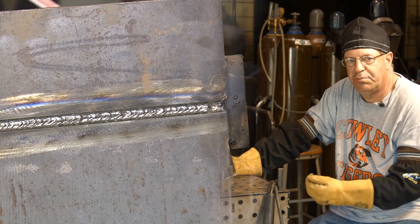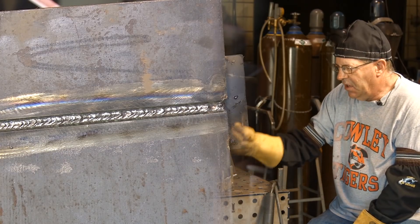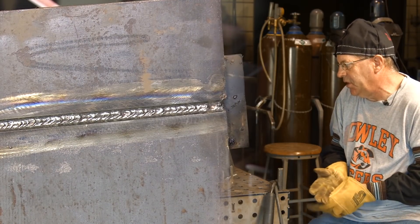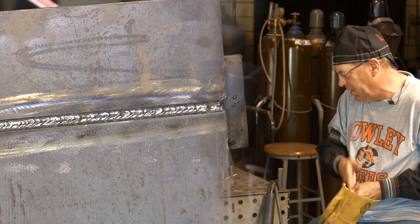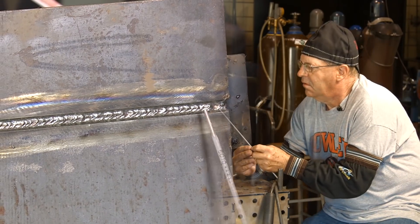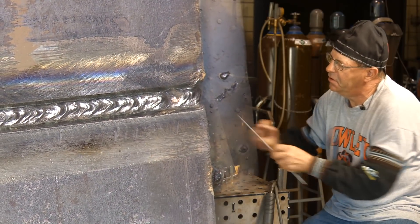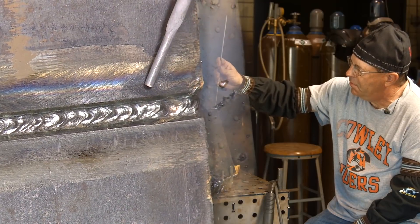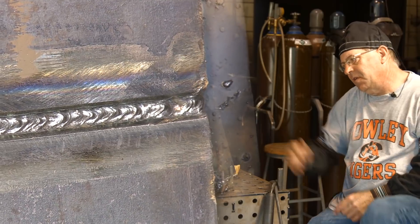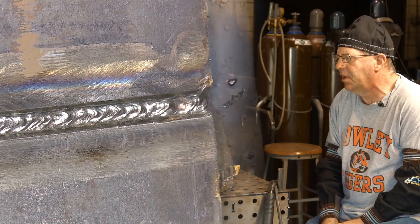Like on monster coupons doing the 6G, you're running multiple passes, and I try to make mine — that's just my personal thing. But when you get in the field and inspect work, the toe of my weld is right here about a sixteenth below this beveled edge, same on the top. You just don't want any undercut, and you want that good profile blended together. Anyway, that's just one of those things I notice from time to time.